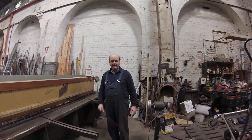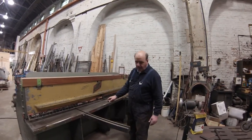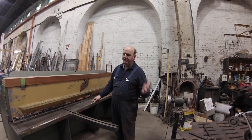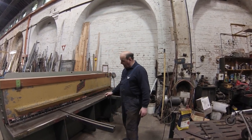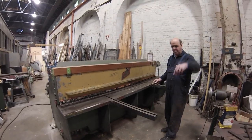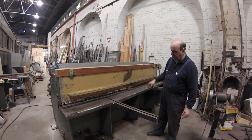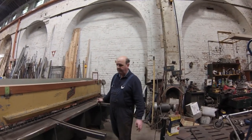Off it came too, and we took it up to NZ. At the same time we took the beam out of the machine — the beam holds all the hold-down clamps in it. We had identified the two that were leaking, but when we got it out on the shop floor we decided we'd do all of them, not just the two, because who knows how far behind the others are from leaking themselves. We got them all resealed. What happens is you put hydraulic pressure into the beam, these screw in, and the hydraulic pressure comes in behind them. A little piston pushes down — the piston is the hold-down clamp — a fantastic design and really easy to overhaul. NZ fixed them all up, we put it all back together, and it's a fantastic bit of kit.